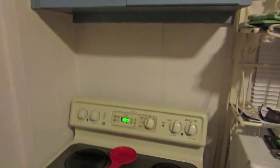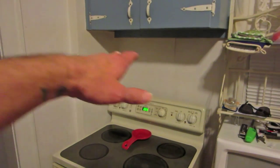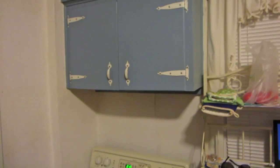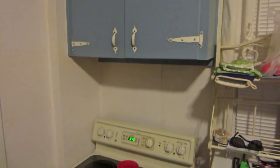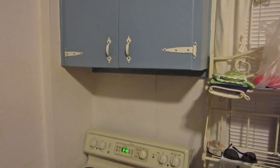Let me ask you guys something — do you see this line right here? That is going to be where the microwave sits on the wall. Pretty dang high up. Does that seem like a good height? There's a minimum distance of 18 inches off the stove top, but there's nothing saying you can't put it up at the ceiling! So we're going to put it at our height to use the microwave, but shorter people won't be able to come into our house and use it. We don't have kids coming and using microwaves, so I think it'll be good.